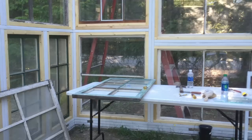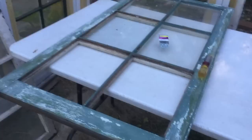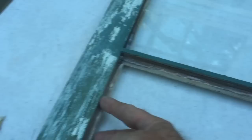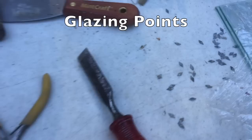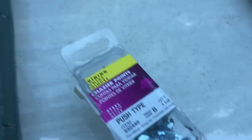I'm still installing some of the windows. To fix windows missing glass panes in these old-fashioned wooden sash windows, I had to get some new pieces of glass. This particular one is missing a few panes and I had three broken ones. I cleaned out the interiors of the area where the glass will fit and pulled out the old glazing points — the old triangular little pieces inserted into the frame to hold the glass. Now I'm installing the new pieces of glass. Glazing points are available at most hardware stores, fairly cheap, quite a few per box.